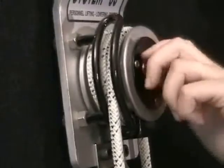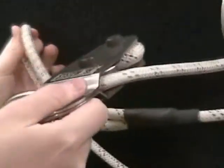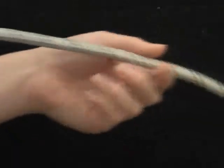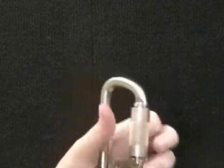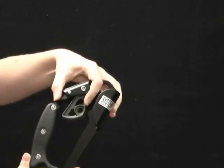To begin, first visually inspect the System 99 and all related equipment to ensure that it is ready to use. Examine the head assembly, pulleys, rope, carabiners, rope control handle, and attach lanyard to ensure that they are all in good working order without cuts, cracks, or excessive wear.